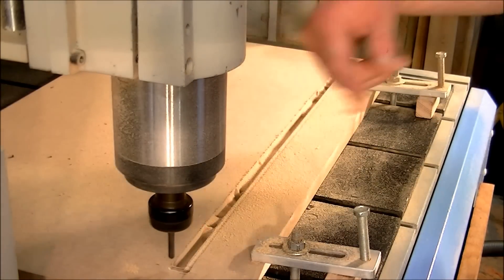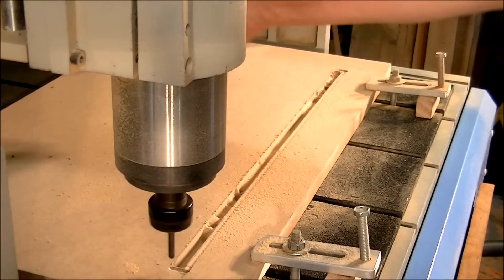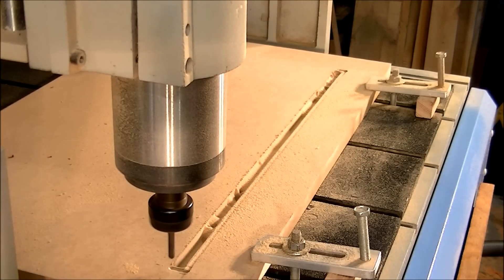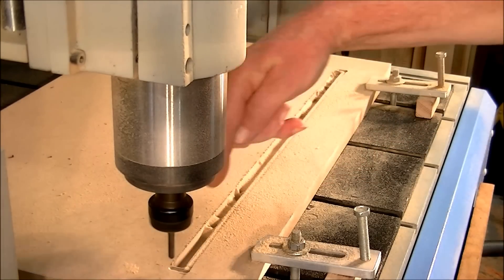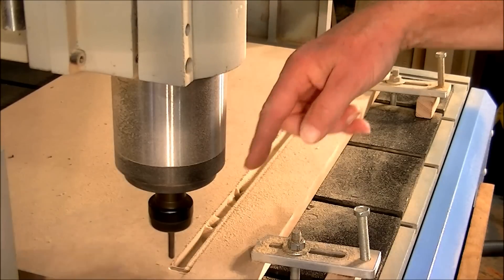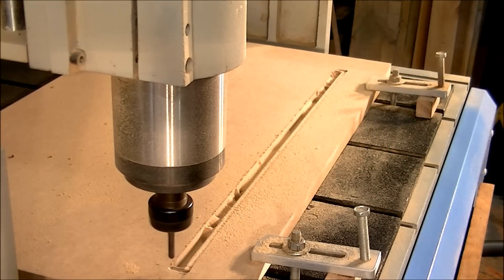This is the trough that I was looking for. So now I don't have to do the full roughing cut with the 6mm. I've made myself a trough in here that I can start the 3mm cutter, and there's going to be no fear of breaking the tool off — well, I hope.